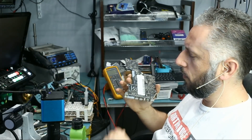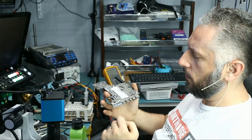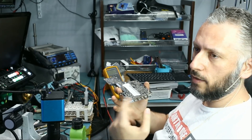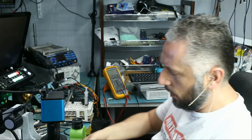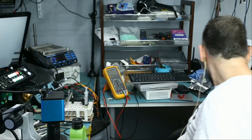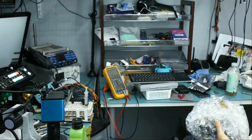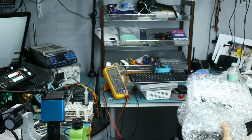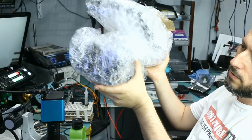What I want to do is remove this port using low melt solder, and from the donor board I'm going to attempt to remove the connector using hot air. So we'll get to see the difference between using low melt solder and using hot air. The customer also brought in about 20 donor boards and asked for a good deal on his repairs.